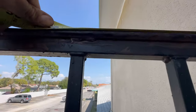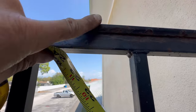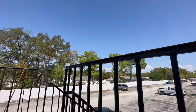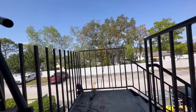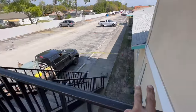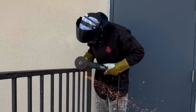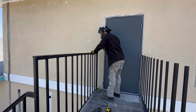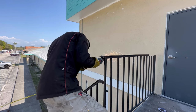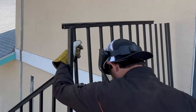We're going to replace about 20 inches of this rail — you can see it's rotten until about right there, and that's about 20 inches. We're just going to notch this off and take it out. The rest looks in pretty good shape. We're also going to need to scoot this out 20 inches because that's what our landing is going to do. The reason we need to extend the landing 20 inches was according to an inspector it needed to be handicap accessible — ironically he caught that but not the five inch spacing between the railing, which is a code violation.